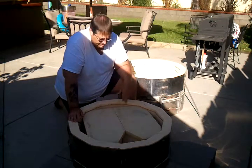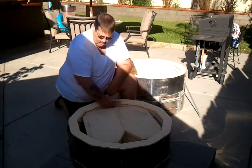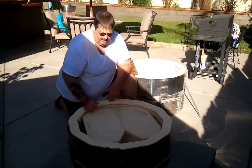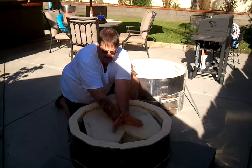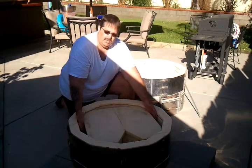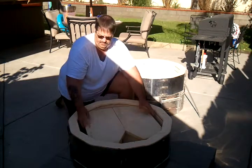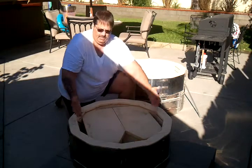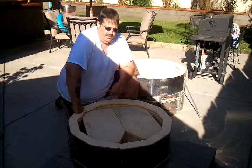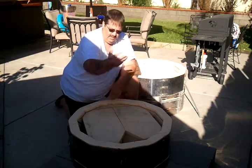Basically, I think I've achieved what I wanted to. As you can see, there's a hole in the front, hole on the sides, hole in the rear. With this apex in the front, or in the back, it's going to divert the heat up the sides. I've got about two inches here, two inches here, to let the heat come up the sides of the kiln, get together at the top, and then work its way down the back of the kiln, and then up the chimney.